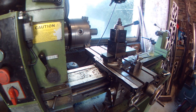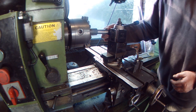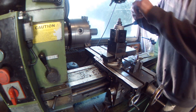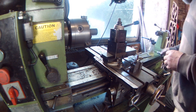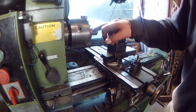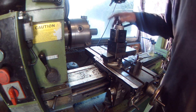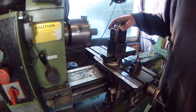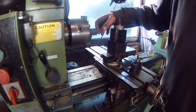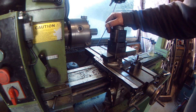I think that's just about right. I'll get the swarf out of the inside, turn it round and machine the other side. The other side is slightly larger in diameter by about 0.2 of a millimetre, so it should slide right over the smaller one and then slide up onto the larger diameter when I install it on the driveshafts.